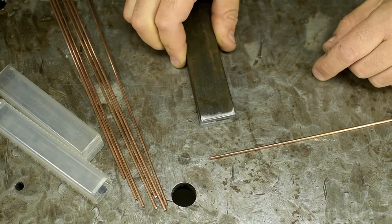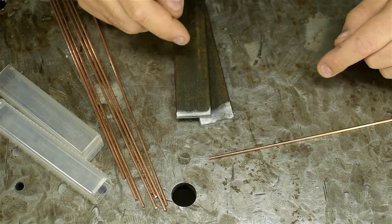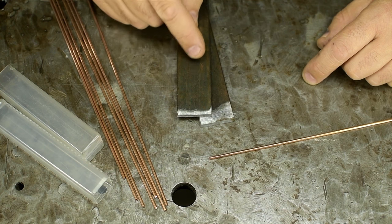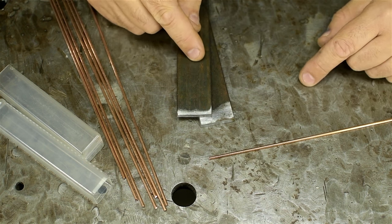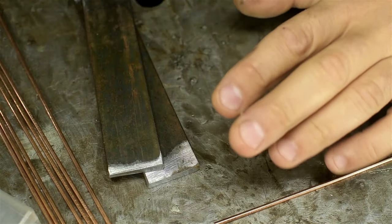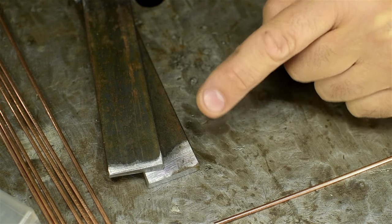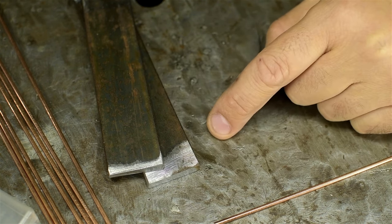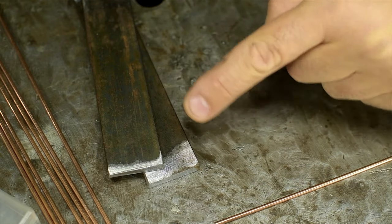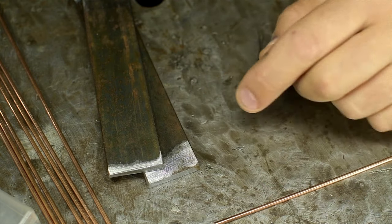Since we're both already here, let's clear one or two things up before we get into screwing around. This is mild steel, quarter-inch thick, six-millimeter flat bar, nothing fancy. And it cannot be hardened. If you try, it'll just get hot, cool down, and be exactly the same. Although you might feel differently if you've ever tried to hacksaw through it, mild steel is not really very hard. In fact, it's so soft it doesn't even make it onto the Rockwell C-scale — the probe would probably just push right through it. So, not very hard in the context of tool steels.